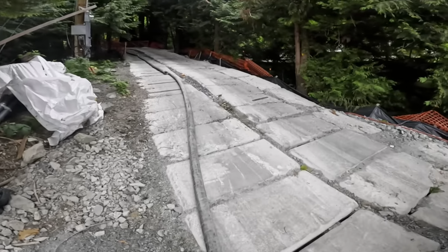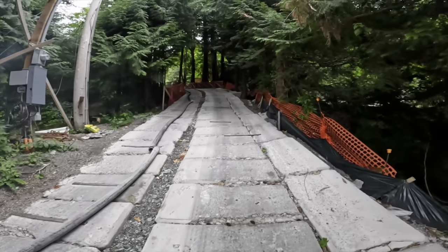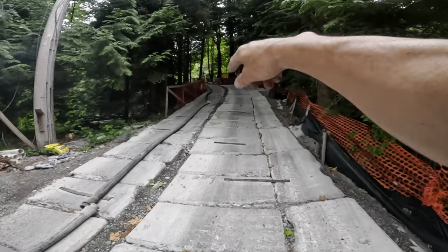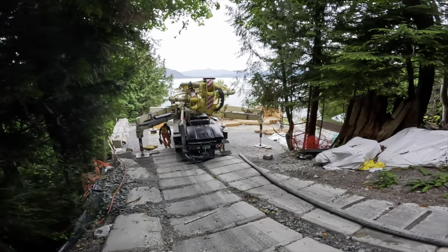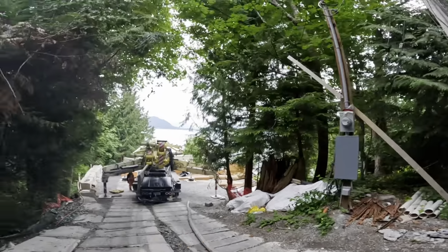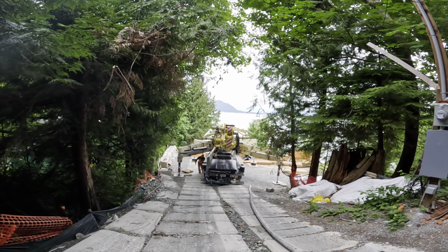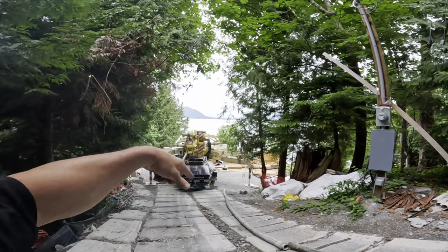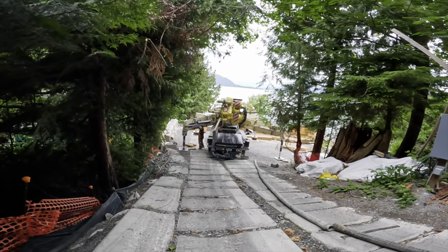Okay, we're going to clamp some hoses together here and get set up. Same as last time. Prime the bentonite all the way through the 24 meter, all the way down the hill, right into the back of the 38 meter here, and then hill reprime. And once again, we are not going into the deck pipe. Reason being, we anticipate some delays today. So we don't want to eliminate our options of being able to recirculate at least through the one pump. And it's only 70 cubic meters, so this is how we do it.